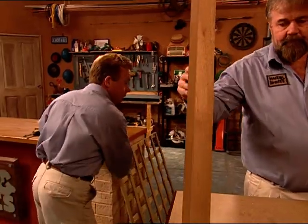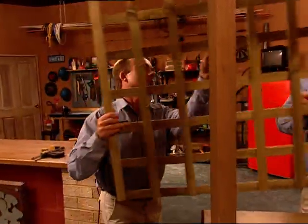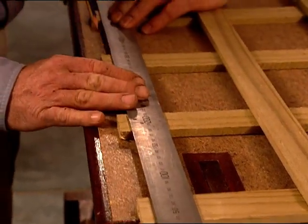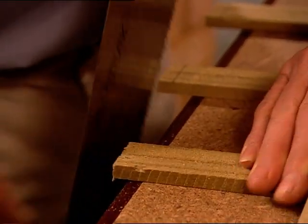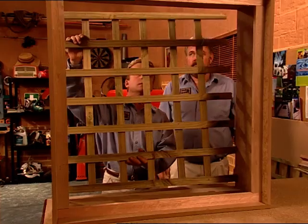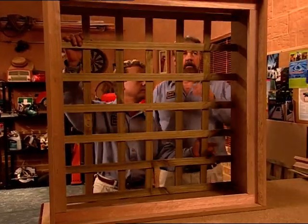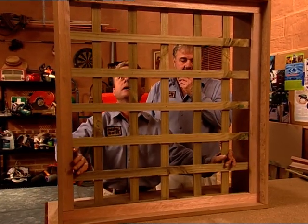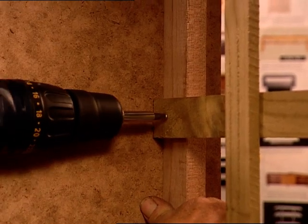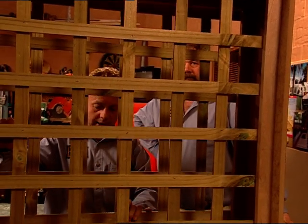Now mark the lattice. We measure and mark the lattice, which we will screw to the Meranti frames. Because the lattice is not manufactured to precision standards, sizes may vary and you might have to remove the batten and trim the lattice to size. When trimming the pieces, select one for the back of the wine rack so that the horizontal frames of the lattice will line up 30mm lower than the horizontal battens on the front piece of lattice. This is to allow your bottles of wine to sit flat.